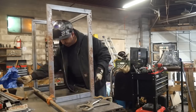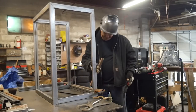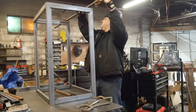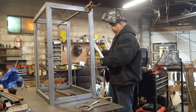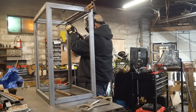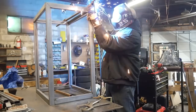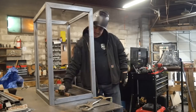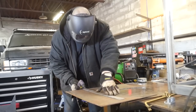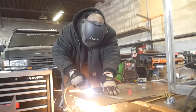I'm clamping down at the bottom, getting ready to spin it around. I would have done that earlier, but what happened was I tacked the thing to the table. I didn't want to pull it apart trying to yank on it — I wanted to get that top brace in first. I'm lining up everything using my pipe clamp to span the whole distance. If you guys don't have any pipe clamps in your shop, it's definitely something worth its money.